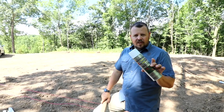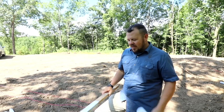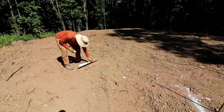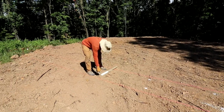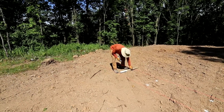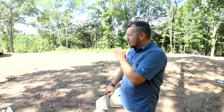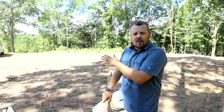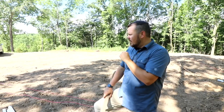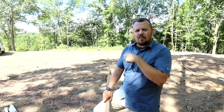We're marking things out and you can see I'm holding a spray-painted white stake, a white flag, and white paint. The reason we're using white is that white doesn't correspond with any of the marking paints of the Dig Right or Call Before You Dig utility marking services. White is in our opinion the owner's or contractor's color. We've pulled our squares, set rebar pins at the corners of our foundation, and we'll mark those corners with white and then mark both sides of our footing.